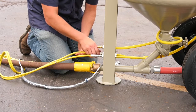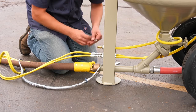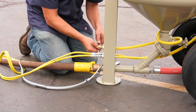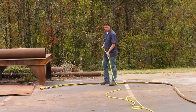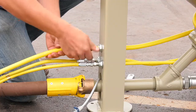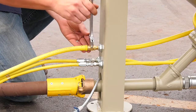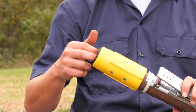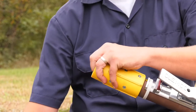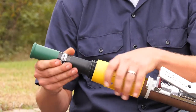Attach the ends of the twin-line hose to the two lower adapters in the fittings on the front leg. Either side of the twin-line hose can be attached to either fitting. Uncoil the breathing hose between the blast machine and where you'll be blasting. Connect the breathing hose to the top adapter in the fittings on the front leg, and then connect the other end to your blast hood or climate control device. Place the nozzle washer in the nozzle holder and screw the nozzle into the holder. The nozzle must seat tightly against the nozzle washer.